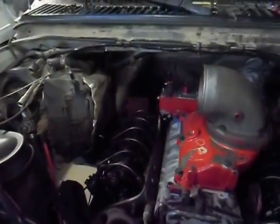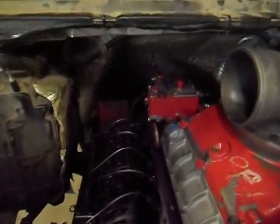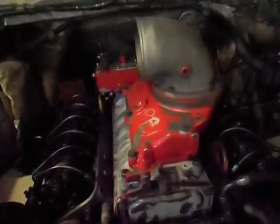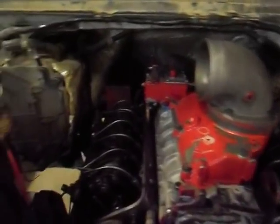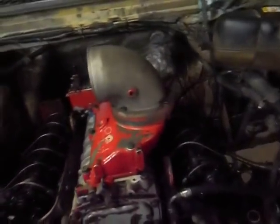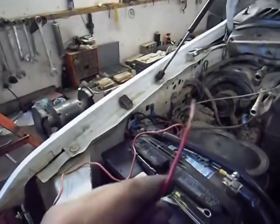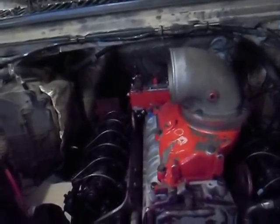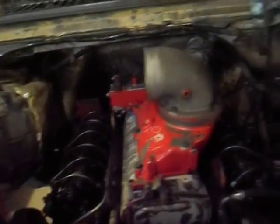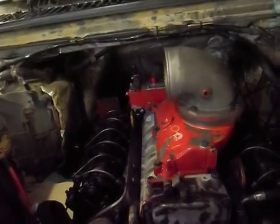I finished connecting the fuel rods to the injector control tubes on both sides. I assembled the cover on the governor and I've put the air shutoff on the blower. So we're ready to try and fire her up for the first time. I've connected a jumper wire to the starter solenoid and I'll just touch this to the battery and we'll see what happens — should fire up and hopefully not rev out of control. Here we go.